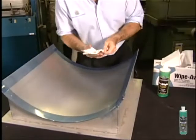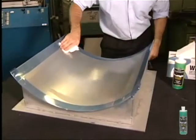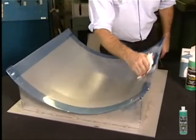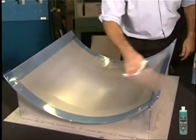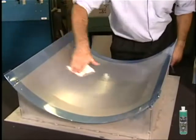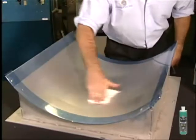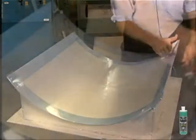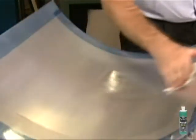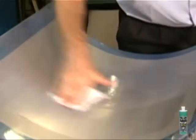You apply PreFlight linearly using the 0-90 method, that is, wiping on each coat at 90 degrees to the previous coat. This first coat will be allowed to dry onto the tool, so do not over-apply. If it runs, you've applied too much. Excess conditioner can pile into ridges which will harden onto the surface. You will see the surface darken, but you should not see any material sitting on top of the surface.